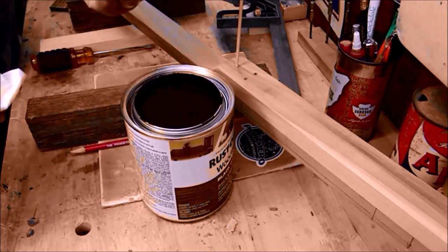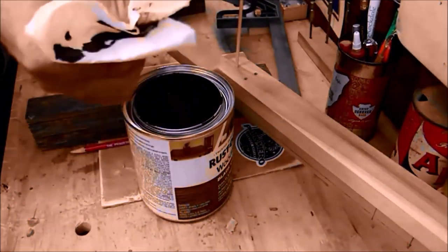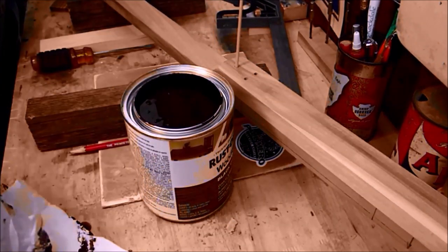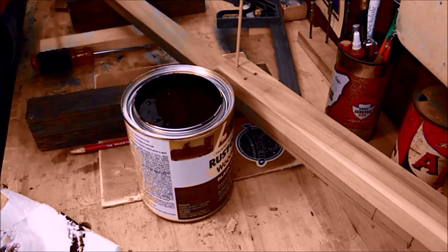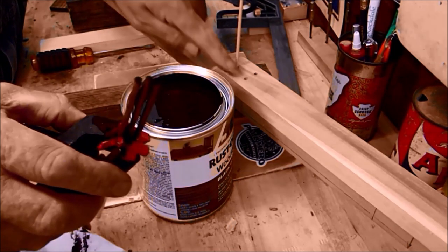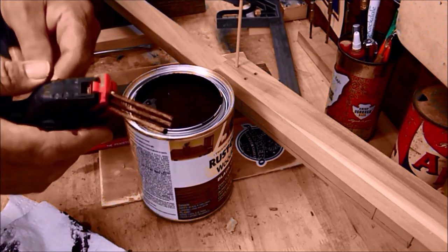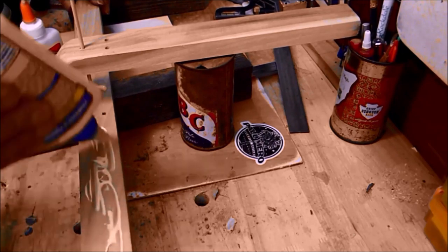One of the things I want to show you — I'm going to want to do some contrast here when I put these in. I want them to stand out because the bottom is going to be visible. So I'm going to take these three dowels and put about this much in black cherry stain and let it soak and then dry. When I drive these in, I'm going to take them all the way through once they're glued up, and that stain will show through and give me a nice contrast and a little rustic look. I want to make sure all of this is cleaned up good so I don't have to do too much sanding afterwards, which would take away the effect of the stain.